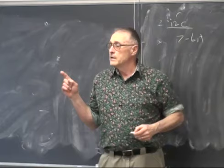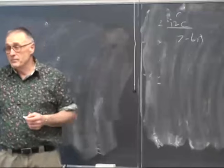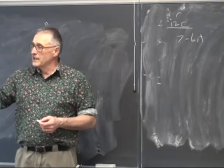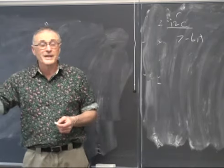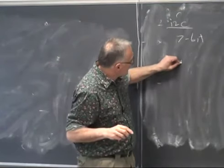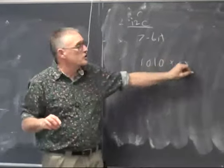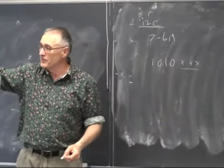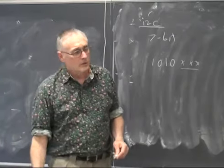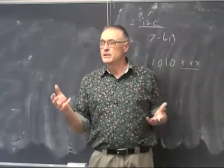The ROM that I'm going to talk about in a little while comes in 8-pin PDIP, but 3 of the pins are dedicated to the lowest 3 bits of the address, so you can put 8 different devices of the same kind. The top bits are hexadecimal A, 1010, and then the 3 lower bits of the address you get to choose by strapping pins to either VCC or ground, strapping them high or strapping them low. So there's a lot of address space, but you have to sort of juggle devices to use all of it.